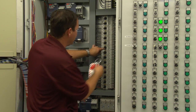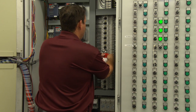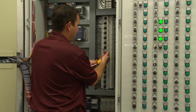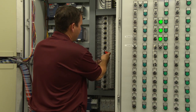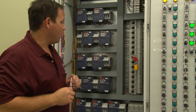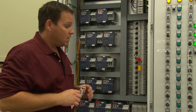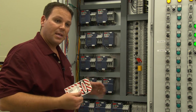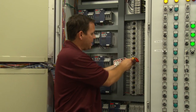This will have a little tab in here I can push in. And just like I did out there on the front, when I push that in, I can put this through here, open this up, place my lock, and lock it. Now nobody can start the equipment while I'm working on the equipment. Again, safety is key in the car wash. When you watch these maintenance videos, they're intended to help you, and we really want to help you be safe. And that's a lockout tagout.